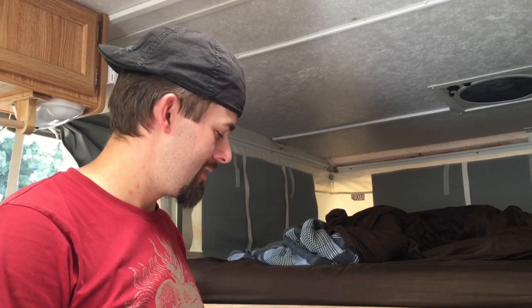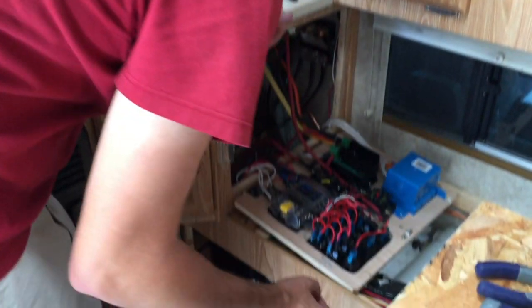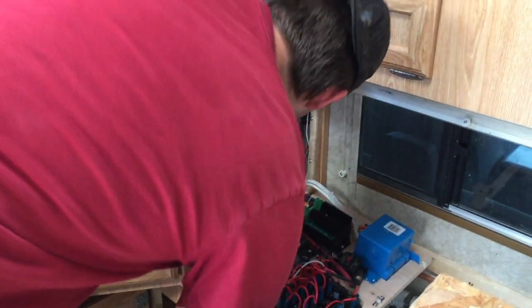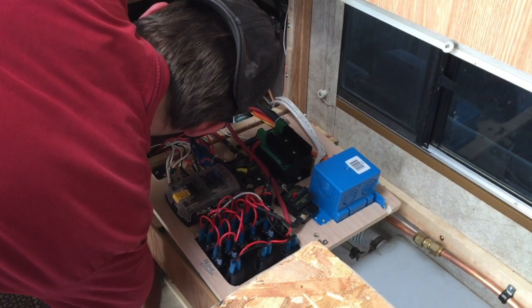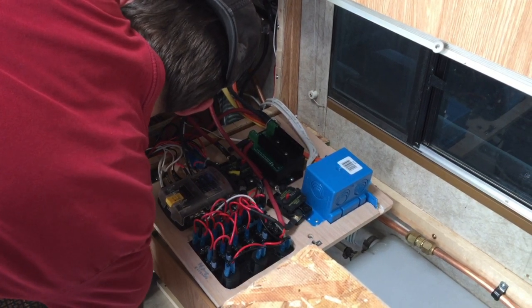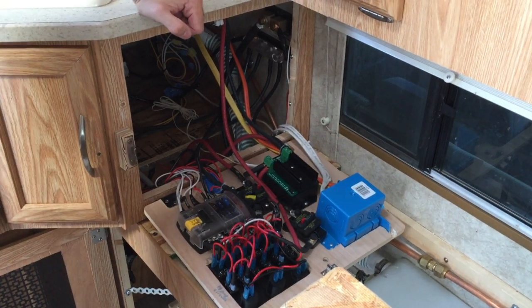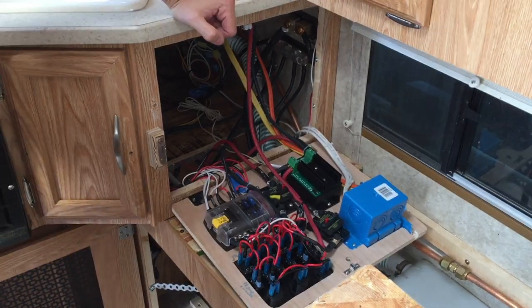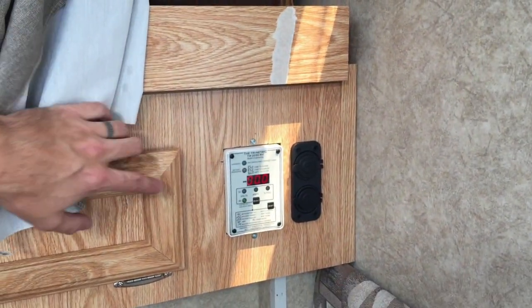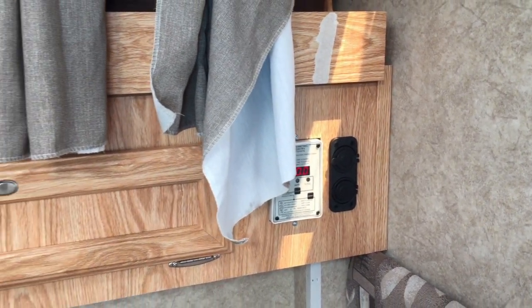I've finally got this thing finished wiring. I'm about to start flipping the breakers so the batteries will start charging — the moment of truth. I've been told this may pop a little, so forgive me if I scream. I'm closing the solar breaker and then closing the breaker to the battery, leaving the breaker to the inverter and the DC system open so the batteries can charge up a little before they start filling that load. Looks like we're getting some readings — zero for now — but hopefully it'll start to charge pretty soon and we'll have our system up and running.